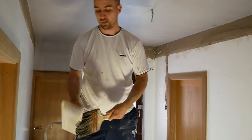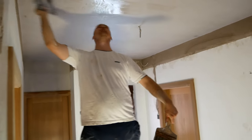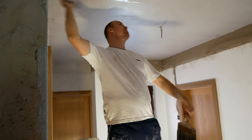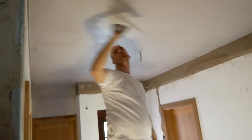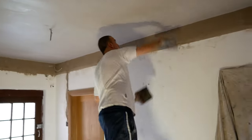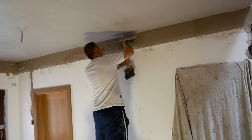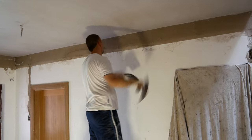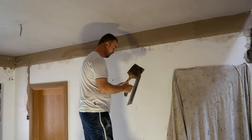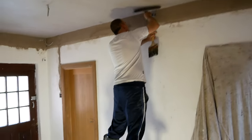In this house, for instance, there's not much airflow, so it won't dry because of that, but it's still quite warm inside. As you can see, I'm wearing a t-shirt, so it is warm inside, which will affect the plaster, it will set quicker. And again, your backgrounds make a big difference. If it's older plasterboard, it will suck in quicker. If you float it over old red brick or something, it might dry quicker. And again, if you're plastering over a bond that's been sitting for a day, it could be quite hot, you might need to PVA it.